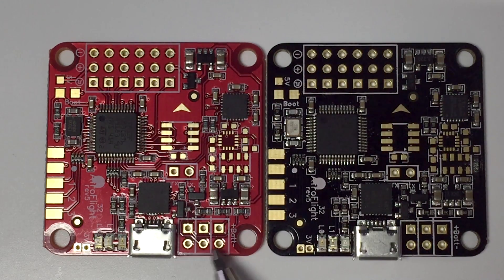Over here in this region we're going to run three connections — keep in mind the negative is on the outside. The first one goes to your battery and to your power distribution, which allows the NAZE32 to monitor the power level on your battery. The second one will be a buzzer — I'm using the same buzzer as in a KK2 board. And finally the third connection goes to your D4R2 receiver, where the green wire connects from the receiver.